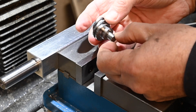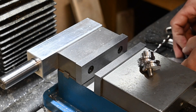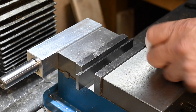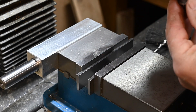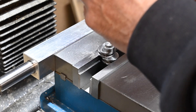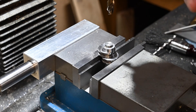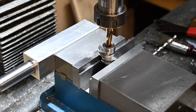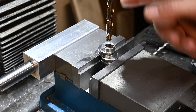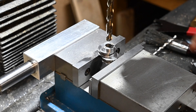That's it — pins squashed down, there's no gap in the middle, everything's how it should be. The mandrel pin still fits nicely in there, which is good. I can put that back into the vice. I've still got the DRO zeroed so I can put that back in just to relocate my position. That's the position relocated — now I need to swap this bit out for a 9.8mm drill and then I'll ream the last little bit up to 10 millimetres.